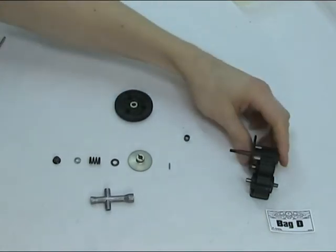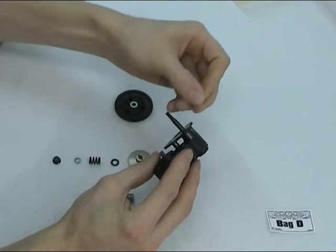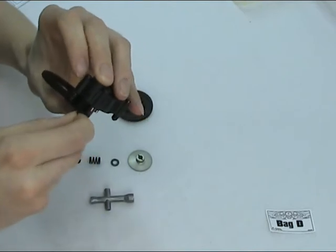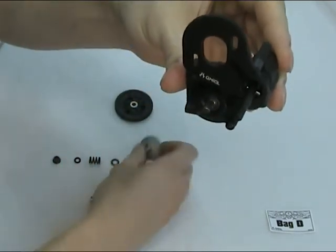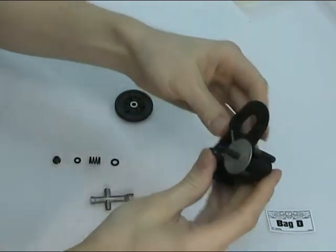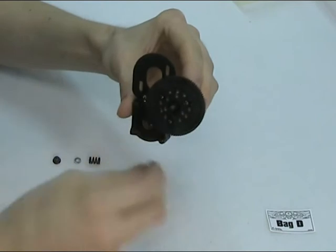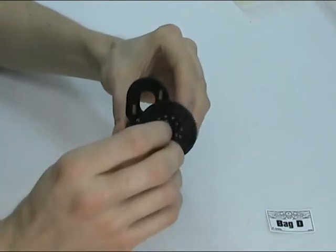Now we can bring these parts together. The first thing you need to do is just install this aluminium spacer onto that shaft. There's a small pin that goes through a hole, and this is quite fiddly to get in because it's all very tight on the motor mount. You may find that tweezers would make this job a little easier. With the pin installed, this plate needs to marry up, and it should then lock in like that. The slipper clutch can then be laid over the top. There are a few washers to go on at this section: it's the larger washer, followed by the spring, followed by the smaller washer, and then a locking bolt.